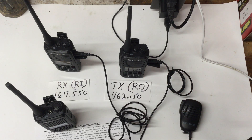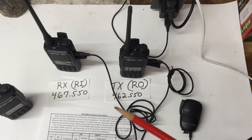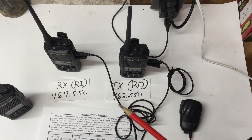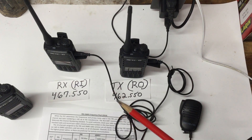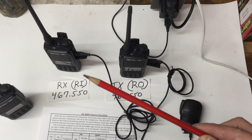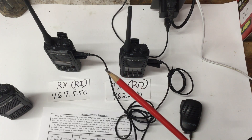This works really well. Now there's going to be some desensitization — since you have two radios close together, the sensitivity will be affected a little bit. I've got a 6-foot cord, so I can separate them by 6 feet, and you could find a longer cord to separate them further. I'm going to do a distance test video using this setup with the radios about a foot apart on a pole, so you can see how it performs.